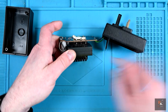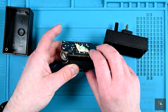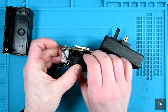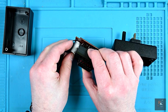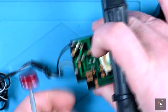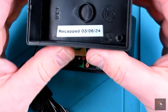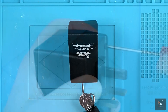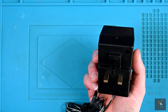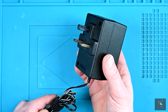So there we are. We've got some very thin wires for mains voltage coming in to the board itself, straight into the transformer. We've got the bridge rectifier network here, tucked down here, and a single capacitor — a 1000µF at 16 volts. They are very simple and straightforward when they're as basic as this. One capacitor, held together with flat blade screwdriver screws. Next, we're going to have to check and make sure this is putting out the right voltage, so let's plug this in and test.